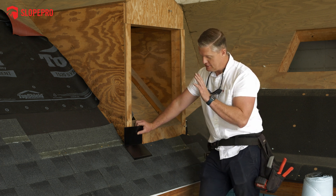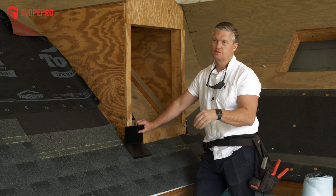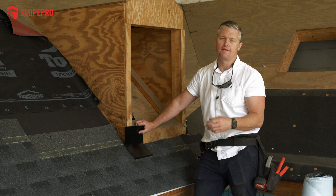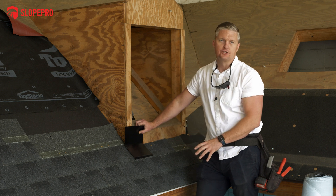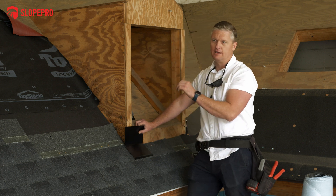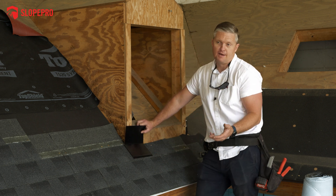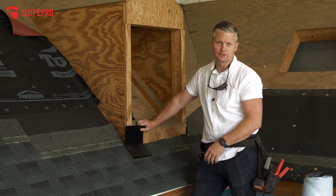You would rather have those leaks show up in a major fashion than as a slow-progressing leak. Because by the time you see a small progressing leak that has leaked just a little bit every rain since the roof was installed - going on for 10 years - by the time you see it in your living room or kitchen, you've got major wood rot and a major repair on your hands. It's soaked through the roof deck and into the framing components and insulation, and little by little year by year you've created an enormous problem. Even though this seems like a very small detail, and some people prefer having the piece covered for cosmetics, it is not an acceptable roof practice because it will create one of those nightmare small leaks.